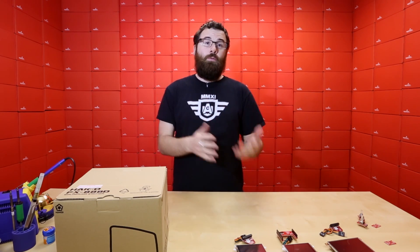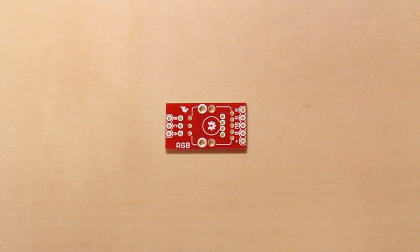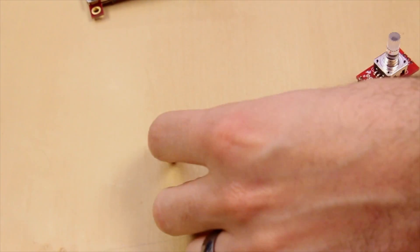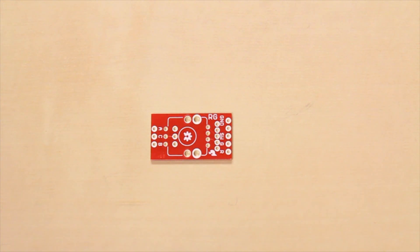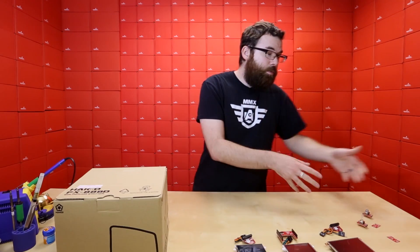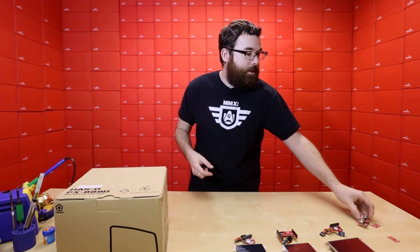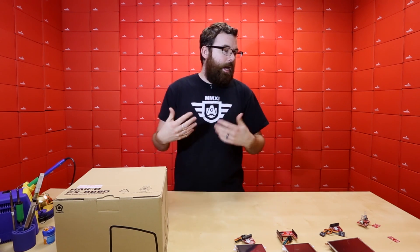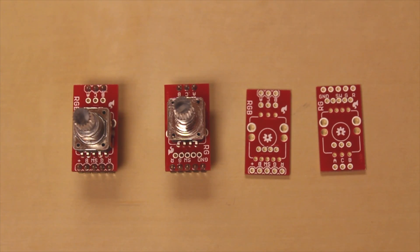So we thought, let's make a version for the red, green, blue. We came up with this — it's really clever. On one side it's RGB and it connects to the RGB encoder. But if you flip it over to the other side, it is RG. So you can actually use this one board just by flipping it on either side with either the red-green or the red-green-blue. The reason we had to make a different one is because the RGB and the RG actually have slightly different pinout spacing for the LEDs, so it required a different board. It's kind of cool — if you have either one of these, you can now use a single breakout for both of them.